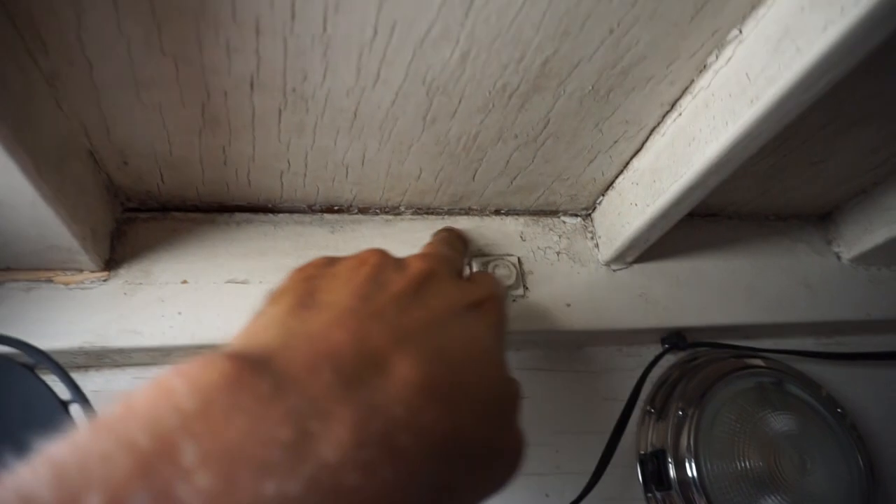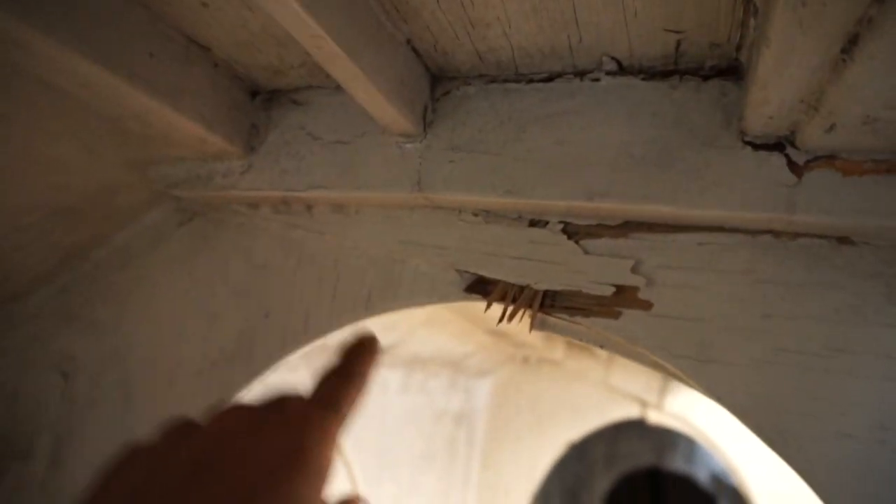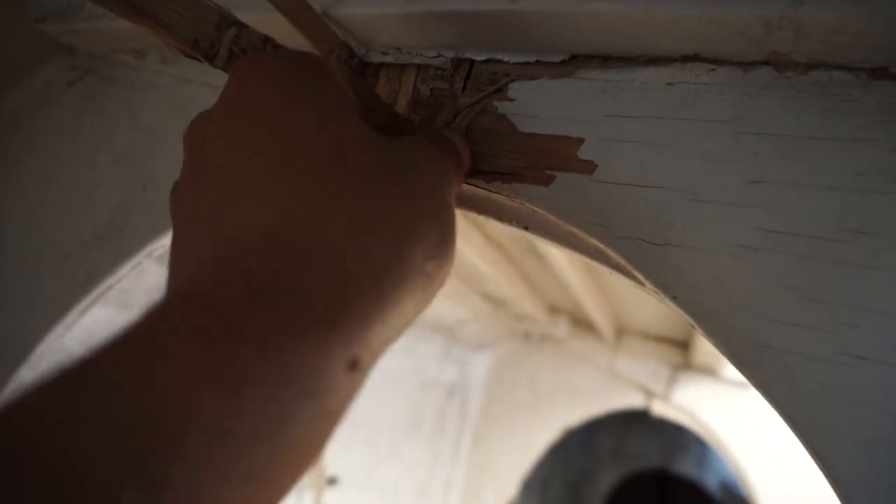So here's the inside from the engine room, the next bulkhead up. It's pretty much delaminated from here all the way back — all the way back, all the way — broke this stringer, and then all the way back here. And then this is also broken. Strangely enough, this side looks like it's pretty good — it's pretty good wood, it's not bad.